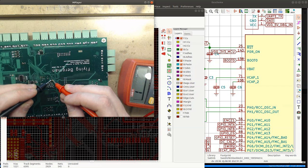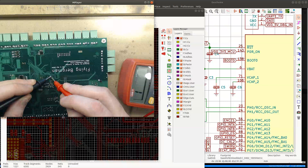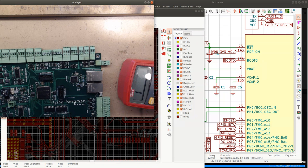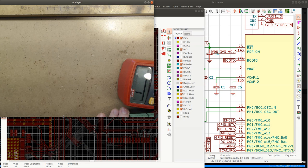Right. I think what most likely happened was that when the power was shorted from the 5-volt regulator to the MCU regulator, it actually busted the regulator inside the ARM chip. I think that's probably what happened. But just to make sure that this board is okay now, what I'm going to do is move the MCU from a board where I know it works to this board. Let's just make sure that this board works. And I'll have to order a few more MCUs.